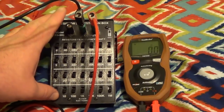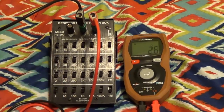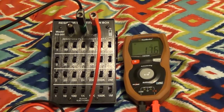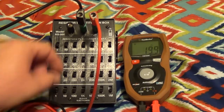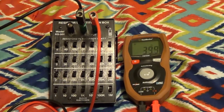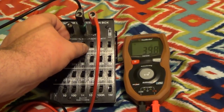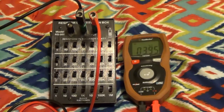We'll get the tests underway. We'll put 1 ohm on the scale and the meter indicates it's right on the money. We'll step up to 10 ohms — and again it gives a reading that is just spot on. Go up to 20 ohms: 19.9, which is certainly well within tolerance. Up to 30 ohms — very much within tolerance. All the way up to 40 ohms: I have yet to notice any overshoot in the auto-ranging. I do notice it usually takes about two or three updates of the display before the correct resistance is ultimately displayed. We'll take a wild step up to 4k ohms, and it was very quick to auto-range with basically no overshoot and well within specification.